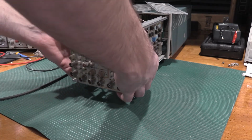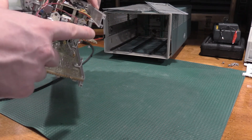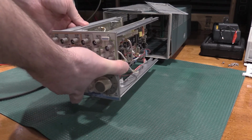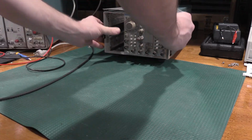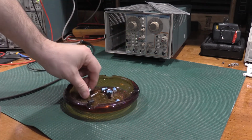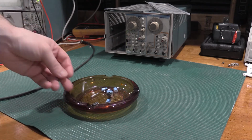So, since I got this apart, it can go in backwards. If you're ever working on these and you have the two locator pins out on the bottom, you can insert the plug-in upside down. It will seat. Don't do that. Electrically, you'll burn it up. So, it's when these pins are out. That's the locator pin. You can put it in upside down.